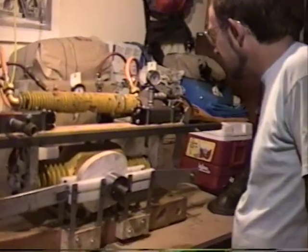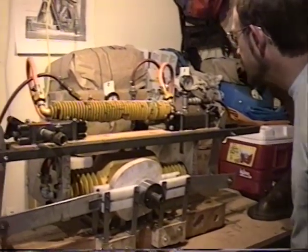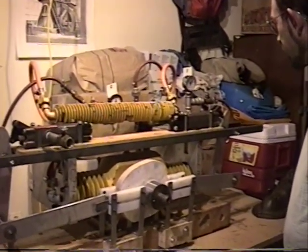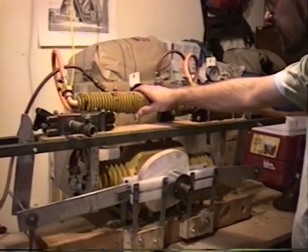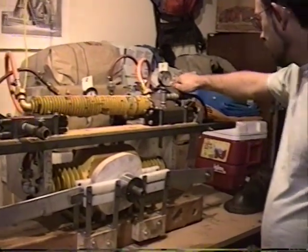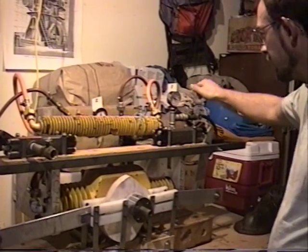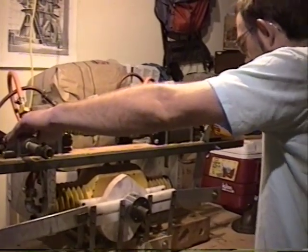So now we got air. 110, 111 psi according to that gauge. Going in, ready to go to stage 1. And I'm going to take some of that air and let it into this heat exchanger, interheater it's called, between the cylinders so that stage 2 will also have a little air going to it when we start up. Boom! Motion. I'm going to try and keep about 50 psi in there. And then once I open this exhaust up and let the air move through the engine, it should start going.